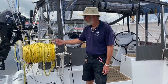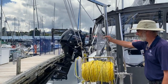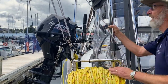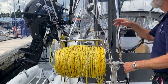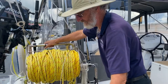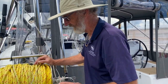Out here, these two lifeline closures should be stretched across to the other side before you go. This is a very nifty outboard crane, and it's made off — the line is here, made off in there. By attaching it to the handle, you just undo this hook and hook it into there, then undo the thumb screws. It's best to have the enclosure covers off, and somebody helps you lift the motor clear and off the outboard bracket. With the dinghy tethered nicely across here, you lower it down to somebody standing in the dinghy, and keeping control of this, they can lower it gently onto the transom board of the dinghy. Makes life very easy.